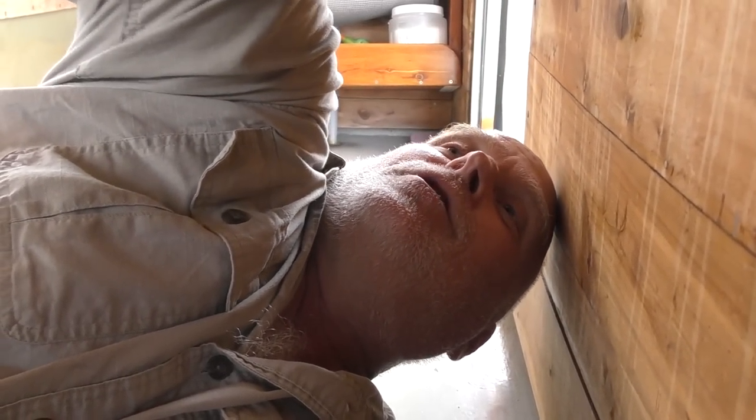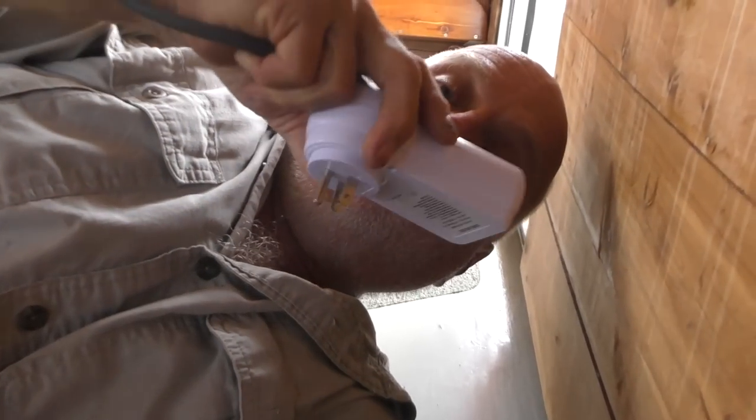Now let's talk about parasitic losses. Got this on my Starlink now, and we are pulling... All right, there it is. Starlink pulls 5.1 watts when you're not doing anything. And when I'm watching a video, it's 45 watts. And if I'm uploading a video, it's 83 watts. So don't upload videos on rainy days. But Starlink, we're going to put it on a switch so we can turn it off at night. Because if we're here, we don't need any notifications from the boat. We've got everything we need.